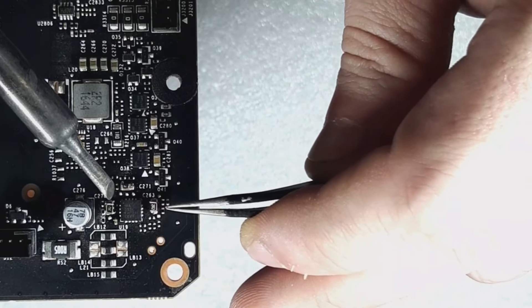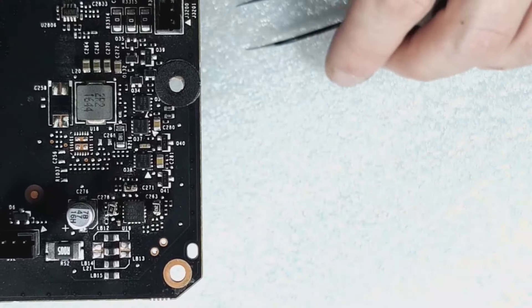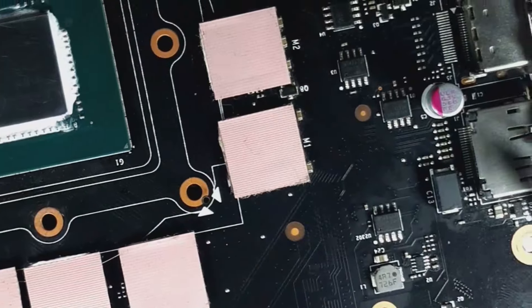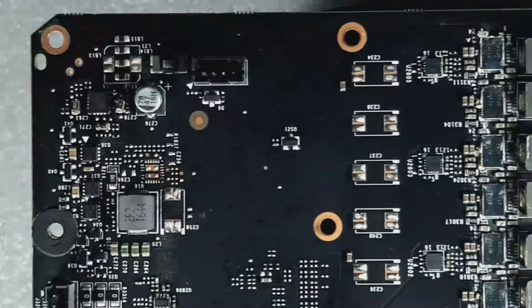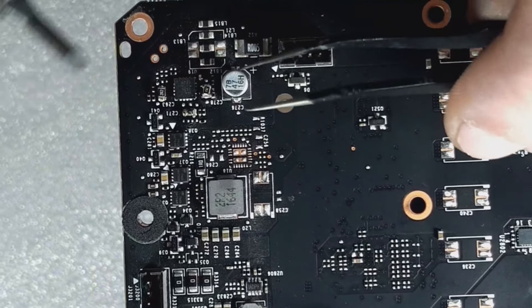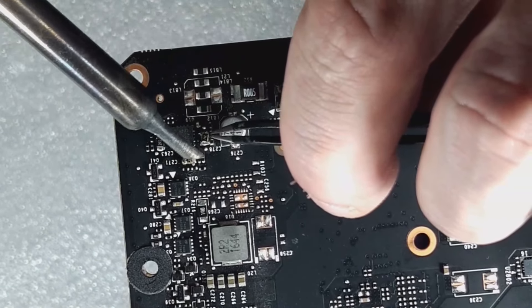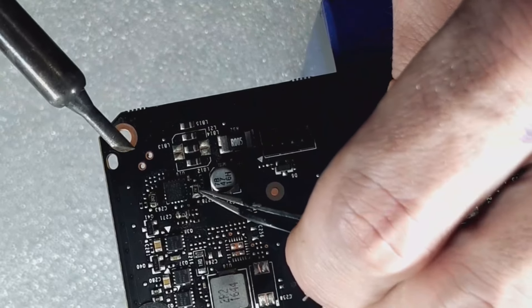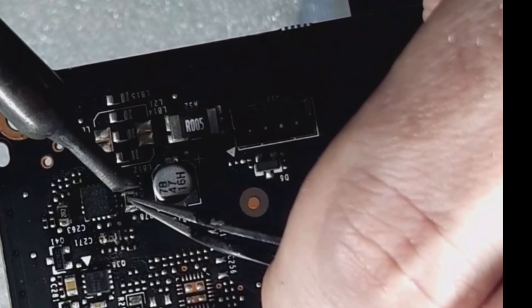Just take your time. If you don't have the greatest soldering iron, keep it heated up — wave it around near the shunt you're soldering to help warm it up without touching anything directly. Preheating the solder joints, component, or PCB before soldering will help the solder flow a lot nicer and make everything turn out much better.